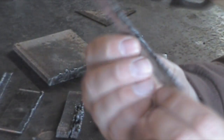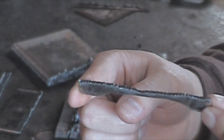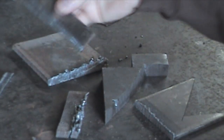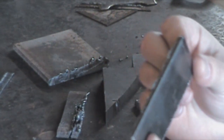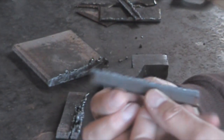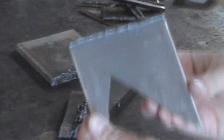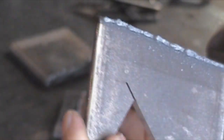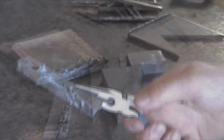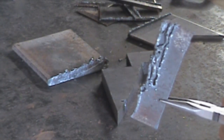Let's look at some of the cuts before I chip the slag off. The 18 gauge 10-amp cut had all the slag on it; the 20-amp cut was the cleaner one. That's a piece of 1/8th inch plate where I fell off the guide. Another piece of 1/8th inch plate — I'm not going to tell you whether I think it's good because you're going to disagree with me anyway, so let's all make our own decisions. That's a piece of 5/16ths with quite a bit of undercut, and another piece of 5/16ths that was under the clamp. This is the 3/8ths with the 40-amp cut that didn't get all the way through, as well as the 50-amp cut that finally did.